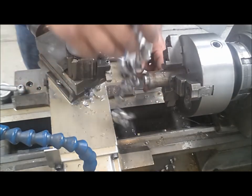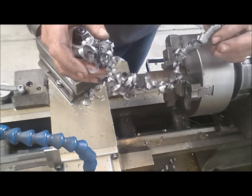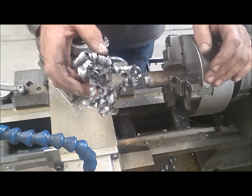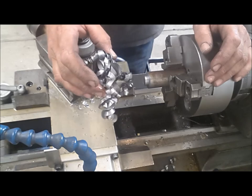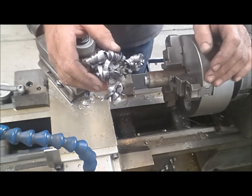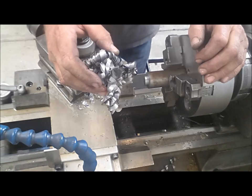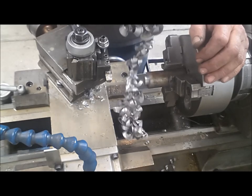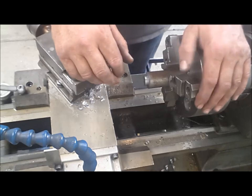There you have it — that was 250 RPM, 0.250 depth of cut, and 10 thousandths per rev. Anything beyond that and we're looking at some chatter, even chucked up tight. Small machine, small horsepower — that's my contribution to chip control. That's the little pipsqueak that could.